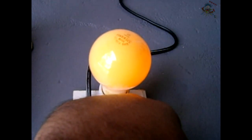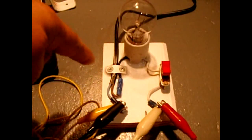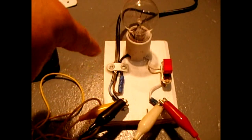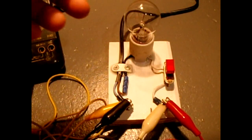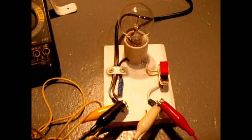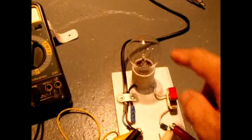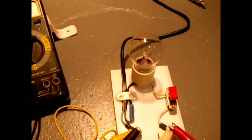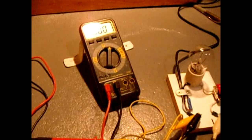It also makes no difference how this bulb is connected to your 120 volts — you can have it feed through the neutral side or through the hot side. As long as the load lamp is in series with the circuit under test, everything will be just fine. Just make sure the load lamp is sized around three times the load that you're testing and you should have no problems whatsoever. Thank you for watching this video; please rate it a thumbs up, subscribe, and post links to this video on other websites and blogs.